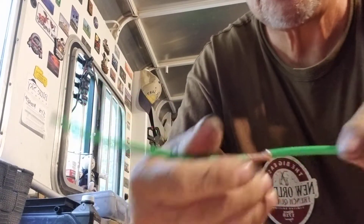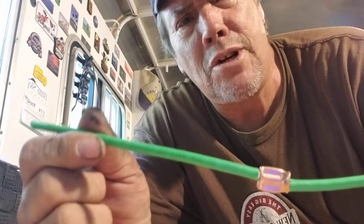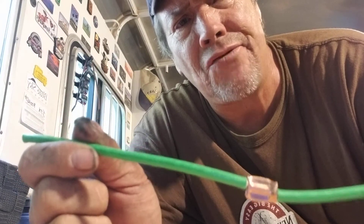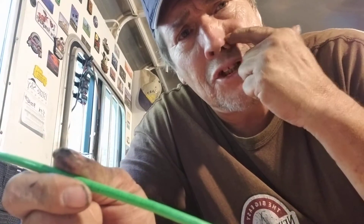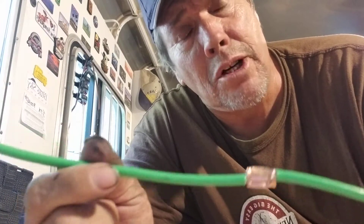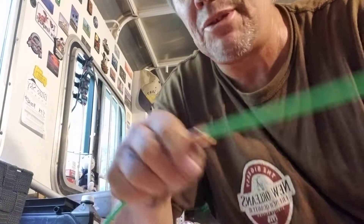That's the outcome right there — that's never going to come apart. MC4 connectors fail because you don't get the same connector that the manufacturer has. When you series them using the same manufacturer they work, but if you use different MC4 connectors they're going to fail every single time.